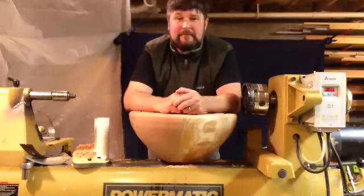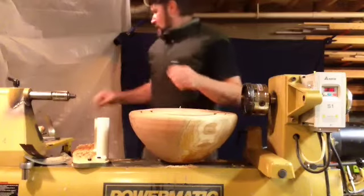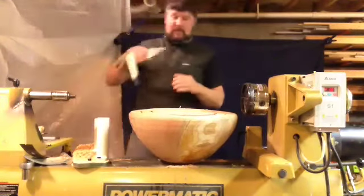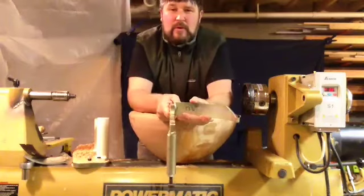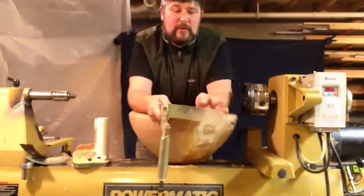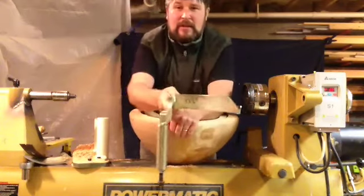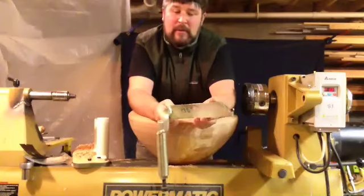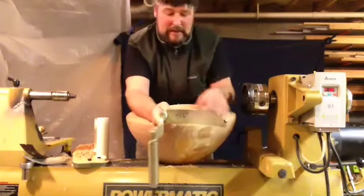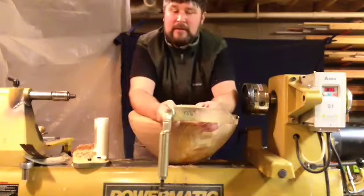Brett, you mentioned in the very beginning that you cannot change the angle and therefore cannot change the shape of the bowls. Is that actually true? Or if you adjust the position of that cutter, can you angle that bowl and make it wider and therefore flatter? You can some. This curvature is fixed. You can change its position in or out, but then your subsequent bowls are not going to be the same thickness. They're going to vary. So you have to keep in mind that you might be thinner in spots than others.